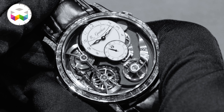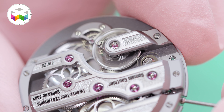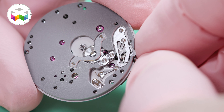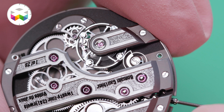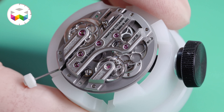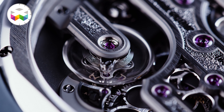The Continuum is an hour, minute, second with stop balance. The stop balance was to take the design of the Logical One with a snail cam — when you pull out the crown there is a snail cam that turns with a rotation. When you have set the time and place the crown at the right position to wind, it's going to turn. So the balance will always have a certain help and inertia to always start. That was not just to touch, but also to create a rotation.